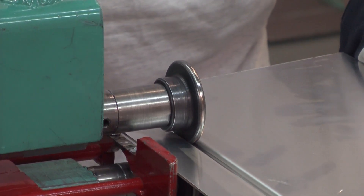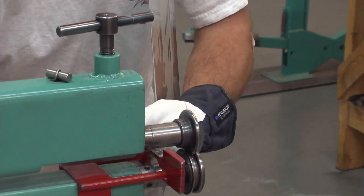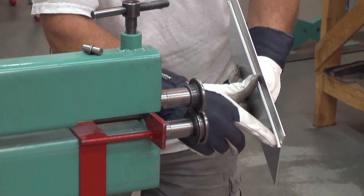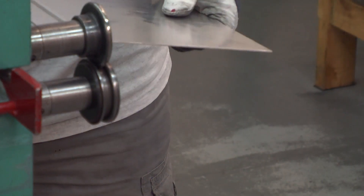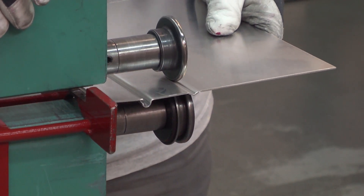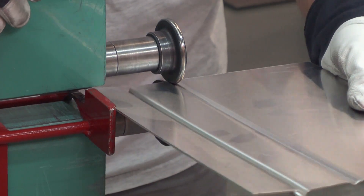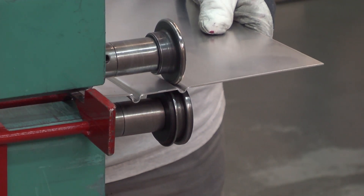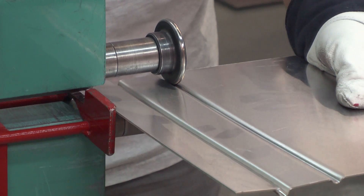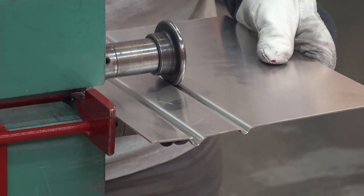It cracked in the beginning — that's okay, I can always cut a little off there. Now I'm going to move this in about like that. You can see it was cracked in the beginning. I'll run it more times now, not so much pressure each time, just increase the pressure a quarter of a turn. That will help it so it doesn't crack.